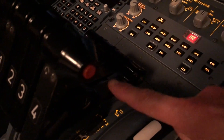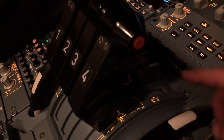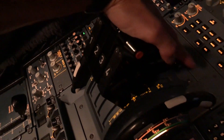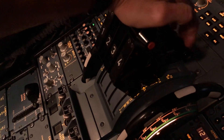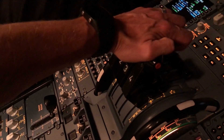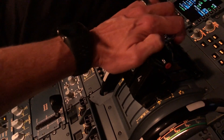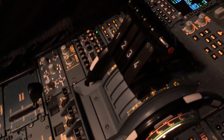In front of the levers here, you can see there's another little lever. This is the reverse thrust lever. On landing, your hand will go right over the panel — fingers on the reverse thrust levers — and you'll just pick your fingers up, pull them out of the normal landing condition. They unlock the reverses and you continue to pull them up to engage reverse thrust, the maximum thrust available.